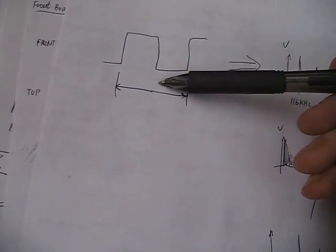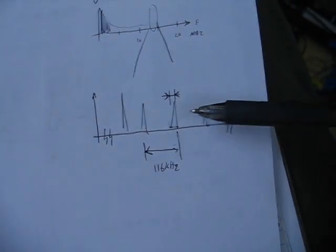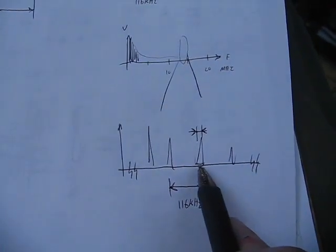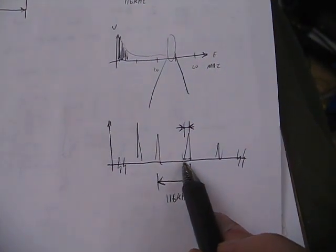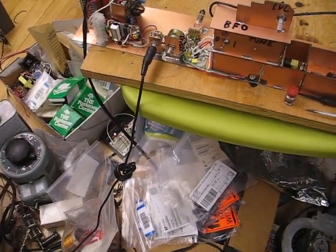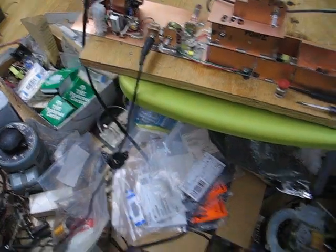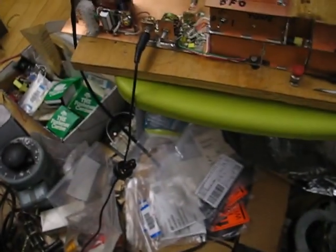What looks like a fairly stable square wave on the oscilloscope — by the time you get out to the hundreds of harmonics — these spikes are very widely spaced, and even though we're at 10+ megahertz, the width of each spike is like 10 kilohertz or so. That's why you get that noisy, rumbling sound. That's within about one turn of the control, which I think is about 10 kilohertz. So as far as being able to say this is a generator of white noise, it's not too unfair — not quite there, but close.